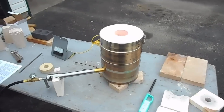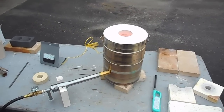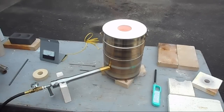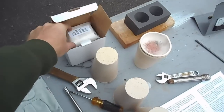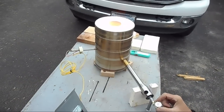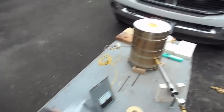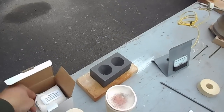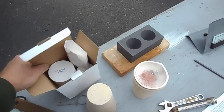We've been half an hour at the designated temperature. Now the instructions tell us to bring it up to 2100 degrees for 15 minutes, then tighten everything. One thing to note: with the kiln you get a little repair kit. If you spill or crack something inside, there's a repair kit for repairing the refractory material with instructions on how to do it. There's also bone ash — you're supposed to sprinkle this on the bottom of the kiln in case you have any flux overflow; it'll prevent it from eating through the bottom. And there's liner restore and other things with instructions for repairing your kiln.